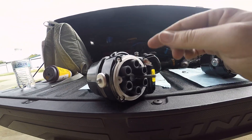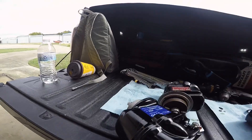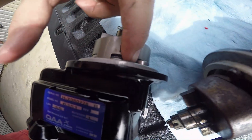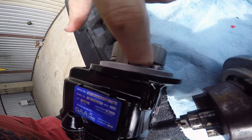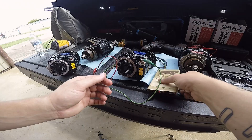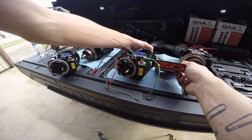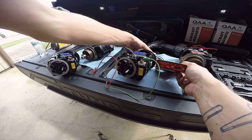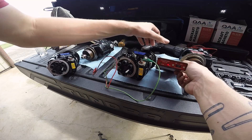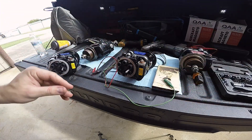These are firing right now — these are in E-gap, firing the number one cylinder, and the impulse couplings are disengaged. Otherwise, this little paw right here would be on this pin. You're going to have to probably reach in there and release that impulse coupling as it comes around. Now I've got this little timing box hooked up. The pin is in there, and if I just barely touch this — it goes off. So when that light goes out, that's when the magneto is actually firing. When it beeps is when it fires.